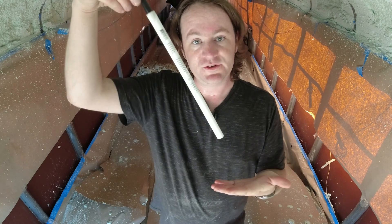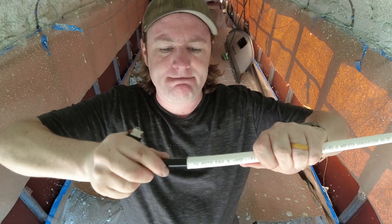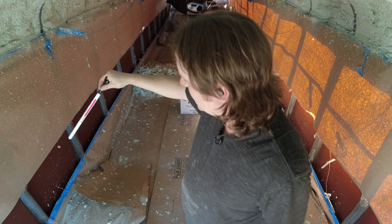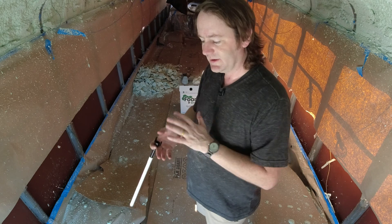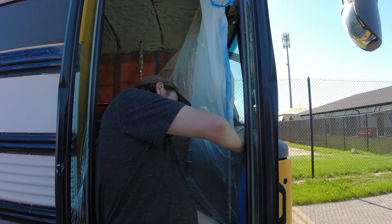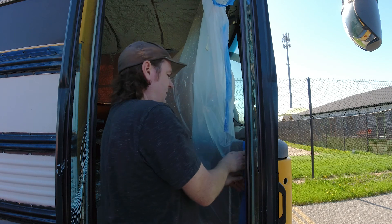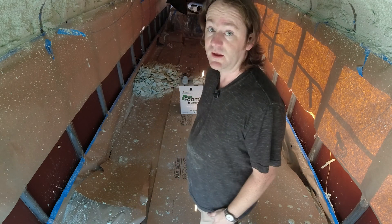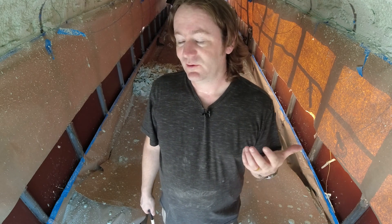One of the things is I need to be able to reach down into a crevasse and insulate down there, so I've extended the gun with a piece of PEX tubing — hopefully it's long enough but doesn't clog up. I'm going to do a small row on the bottom of every cavity first to form the base, then try filling in with chunks from the stuff I've had to cut off the ceiling, just to save some of that waste. I don't want to create air pockets so they've got to be small chunks. Start with the base so nothing falls out the bottom, then fill the gaps, put a cover on, and fill the sides. Hopefully I can reduce the amount of trimming that has to be done. Spray foam and I don't exactly get along.